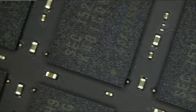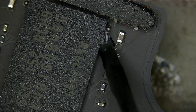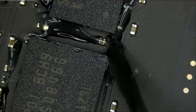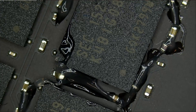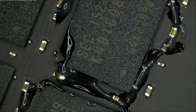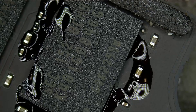Right now we're going to start by reflowing. Maybe we can start from the ones that are reading 0.35. I'm going to apply some flux and reflow the last two chips — maybe two chips at a time. Hot air station at maximum, 500 degrees Celsius, and air speed just a bit down so we do not push all the flux away. And of course, fume extractor — very important.